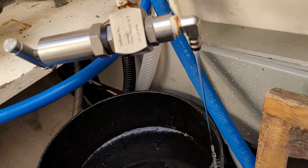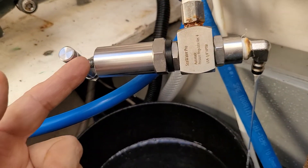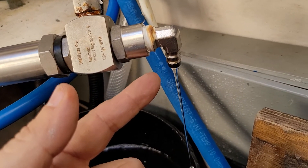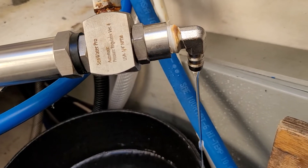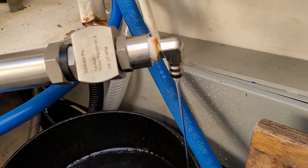So how do you know if it's 30 or 45 minutes? Measure this water here, having left this at 800 psi, and interpolate what it takes to run three gallons through the system to rinse it — and that's how you adjust the time on the timer. Again, if you have any questions, you all have my number. See you out there.